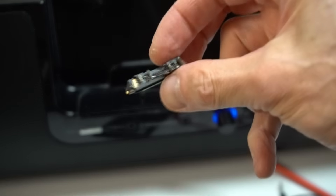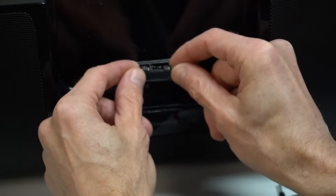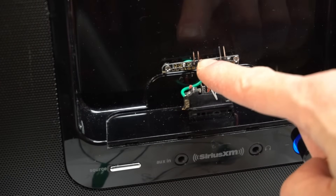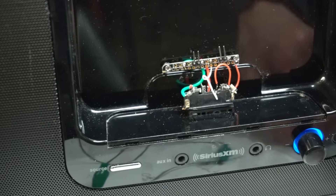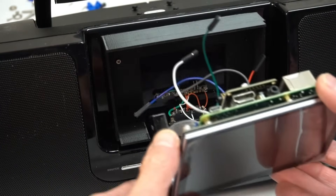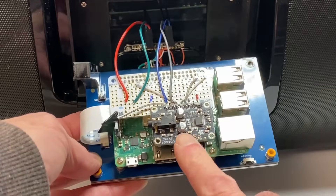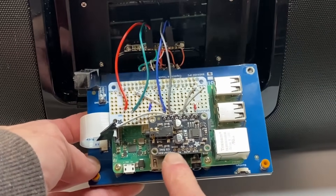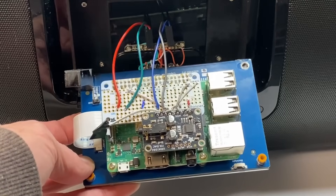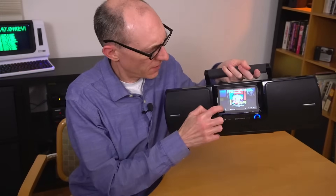Amazingly, it came out in one piece, sort of. And I was able to tap out and then solder small wires onto the connector's pins for audio and power, and extend them to a header so I could connect the Pi. Next, I designed and 3D printed a bracket to hold the touchscreen assembly in place. For better sounding audio, I'm using this tiny i2s DAC that connects to the Pi's GPIO pins and provides decent quality analog audio out. Now I have a portable touchscreen music streamer, which sounds pretty good.